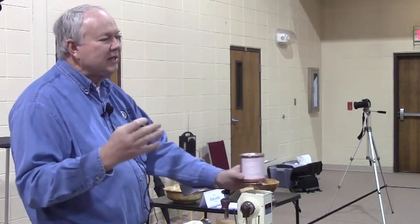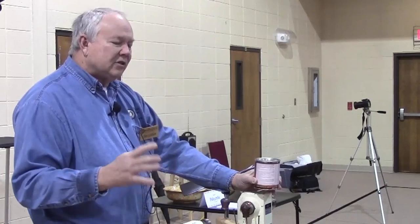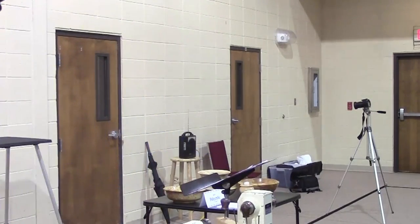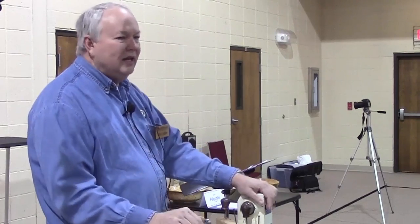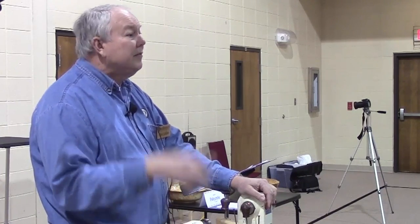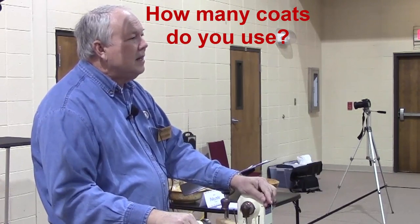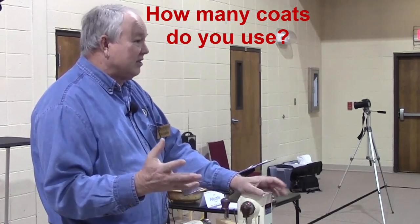Because sometimes cells get sanded closed and then they open up, anytime between coats I'd do a little sanding. On spalted woods I'd have to do a lot more because the wood would change. Using Seal the Cell Clear as a base sealer coat seems to eliminate a lot of that sanding between coats.